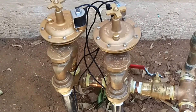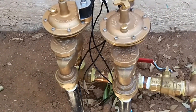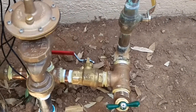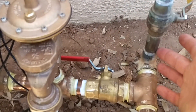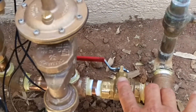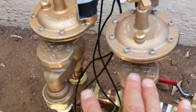What we replaced here was some brass valves and brass valve actuators. This is a great design. It's coming straight from the main line coming in, and there's a shutoff here that goes to the house. They went ahead and made the connections below the shutoff that goes to the house, and they put in a separate ball valve shutoff just for the irrigation valves.